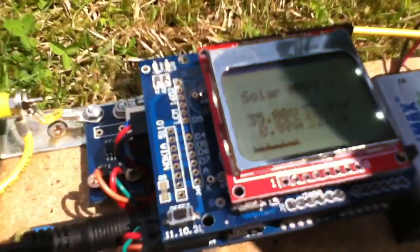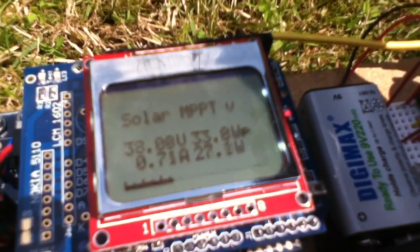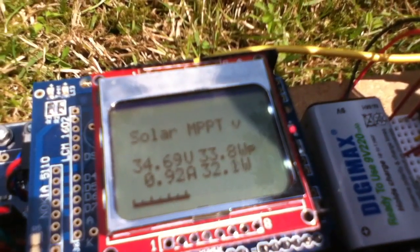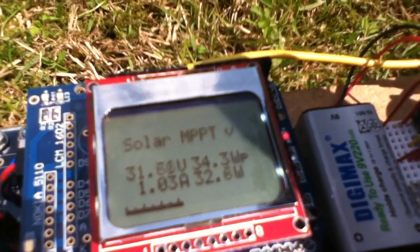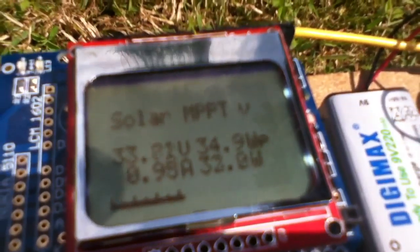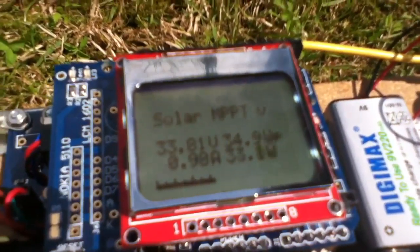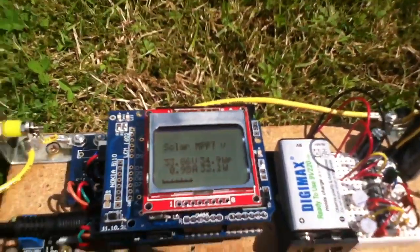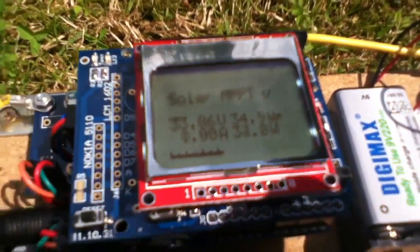That's the limit of that capacitor, but I'm just going to push on a little bit. 37 volts — and it seems the power's dropping back, so I'll ease back. 36, 35. Moving backwards and forwards to find that maximum power point — it seems like it's about there. The peak watts we got was 34.9W at 33 volts. That seems about right; I was predicting about 35 volts for the maximum power point. Currently hovering around 32–33 watts.